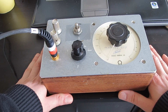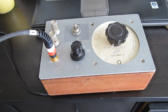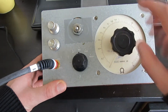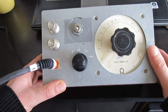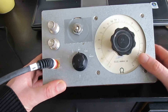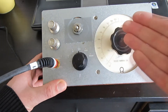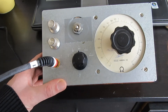I'll include a schematic download in the description below so you can take a look at it yourself and hopefully create something cool. Let's take a closer look. We have a carrier and a modulator — these two knobs control the frequencies of each voltage-controlled oscillator. This switch right here synchronizes the modulators on both voices, so both voices have the kick at the same timing.